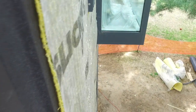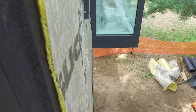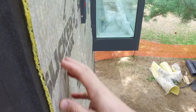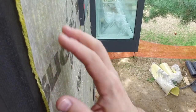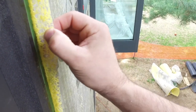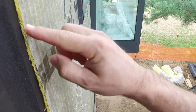This is pretty cool. You can see here at this connection point, the Slicker is holding us off the house by about three-eighths of an inch. That's really important. It's also important that we have this Slicker Max, which helps keep this entangled matrix from compressing. Because a point load could compress it, but this fabric helps reduce that.